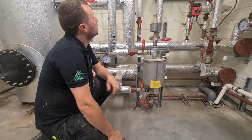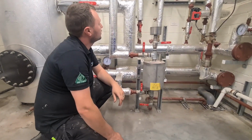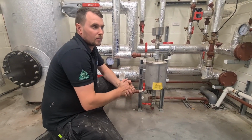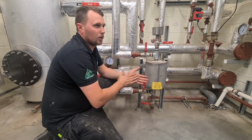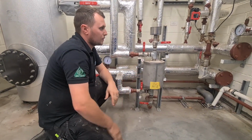Actually, it's not, because it's got a CT and a VT. Oh, I thought this was all underfloor, this one. Please tell me, what's a CT circuit? Constant temperature. And why would you install a constant temperature circuit? These are on air handling, is that right? Can be on air handling units or any systems that require heat immediately.